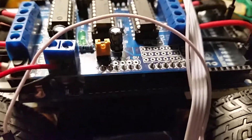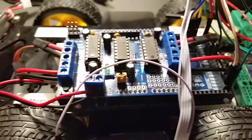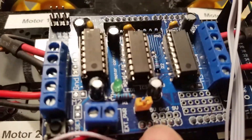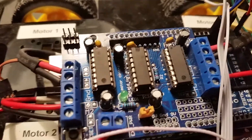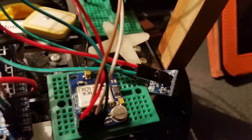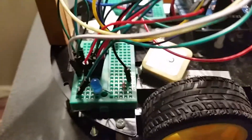Down here is a regulator that reduces voltage from 5V to 3.3V. The Arduino Mega has a 3.3V output we could tie into, but unfortunately the Adafruit motor controller is sitting right on top of it, so the only way to access it would be to solder onto that jumper. I opted not to do that and went with an external reducer instead.